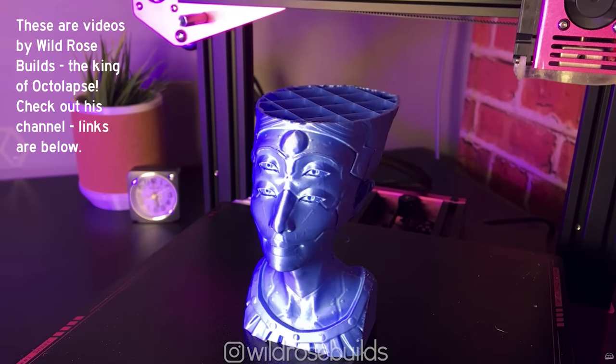On the topic of the first layer, number four is leveling the bed using a skirt. The skirt draws a line or two around the object before printing starts — that's the perfect opportunity to make micro adjustments to the four knobs on the outside of the bed. I still recommend traditional leveling with a card to get approximately the right height, but I put a skirt on pretty much every print so I can watch those first couple of minutes and make any adjustments. I call this on-the-fly skirt leveling and it has increased my first layer success many fold.